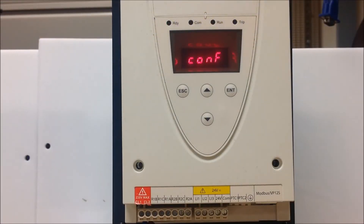In this video we'll show you how to wire an ATS 22 soft start with a suffix of S6U. The first thing you want to realize is that this soft start accepts control power of 120 volt or up to 230 volt AC. The terminations you have to be aware of are CL1 for your hot and CL2 for your neutral.